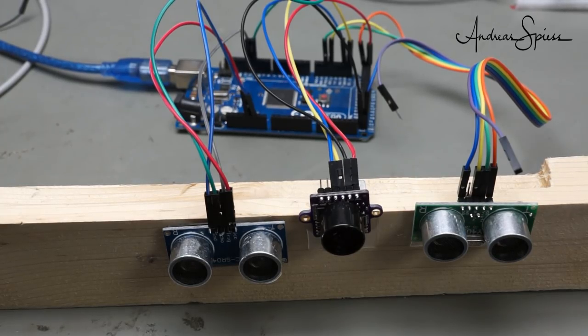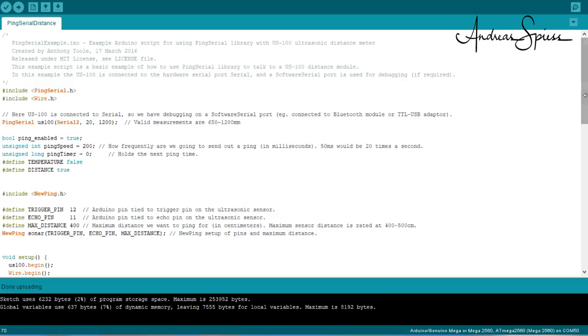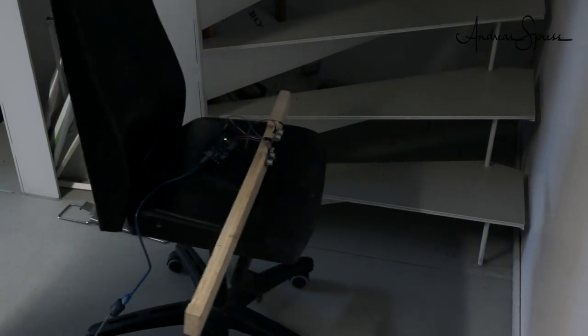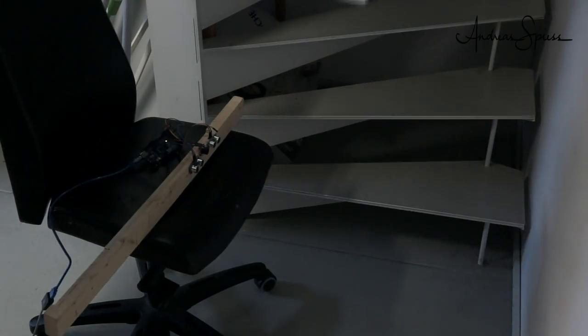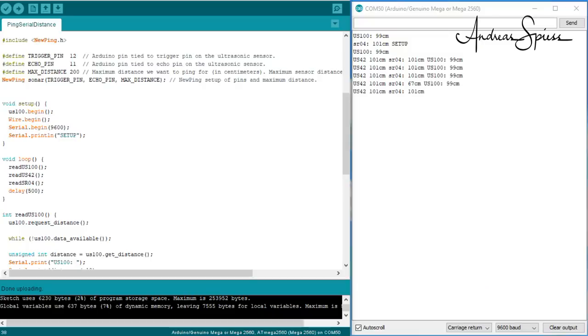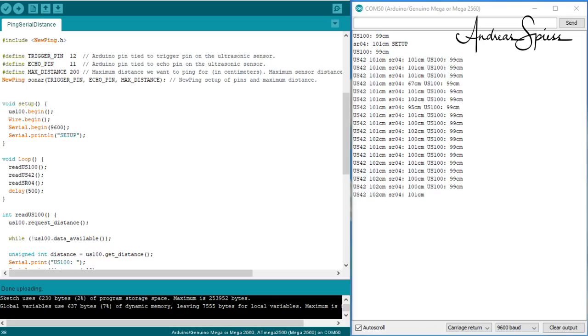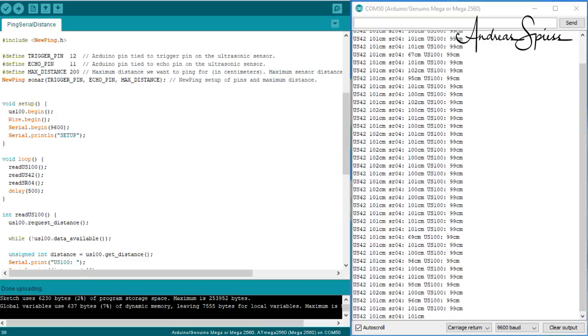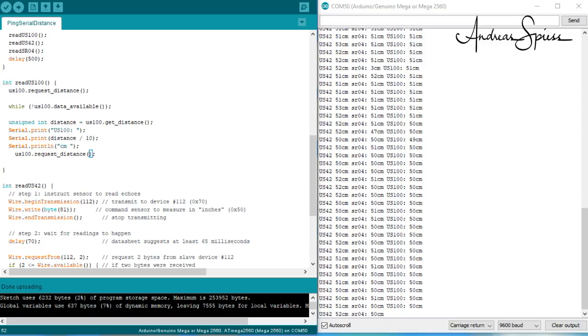To compare accuracy, I stick three sensors in parallel on a wooden stick and connect all to the same Arduino Mega. All libraries work in the same sketch and because all sensors use different pins, we can run all three in parallel. I place the wooden stick on a rolling chair in front of a flat wall, which is quite hard and reflects sound very well. At one meter distance, all three sensors measure within about 1 cm plus or minus. From time to time one measurement is entirely wrong — because all devices use the same frequency, they can disturb each other. This should not happen in reality where you usually have only one sensor in a particular direction. At 50 cm the accuracy is also good, and these results are comparable with the results in my old video.